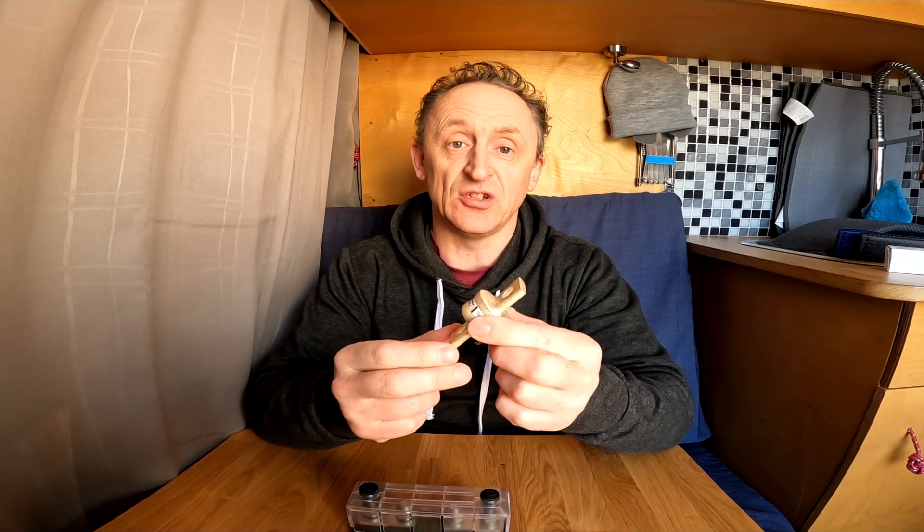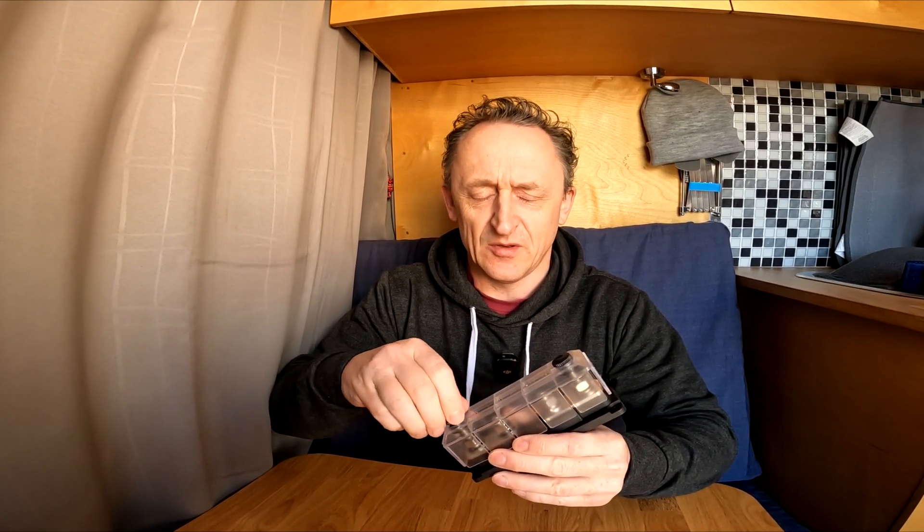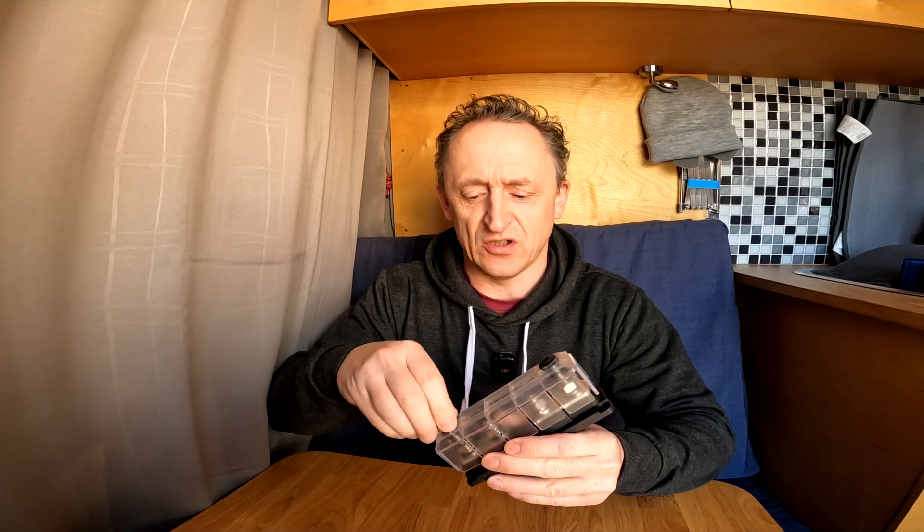I will leave links in the description to the items we've purchased. It cost us all in all about £150 — I did buy two fuses just to make sure we have a spare. So let's show you what we have. First off is the fuse — this is the 400 amp T-fuse, rated to 300 volts. Second up is the holder — this is a humongous holder, it has to be because the size of the fuse is far greater than your standard mega fuse, about two and a half times the size.